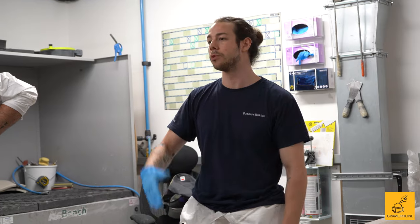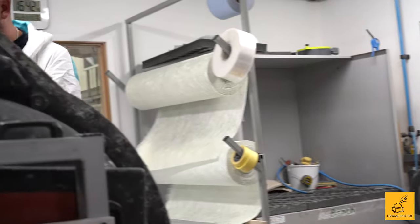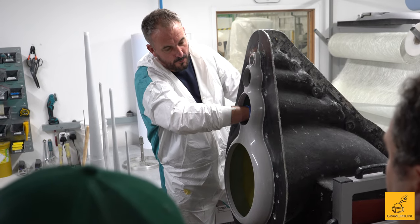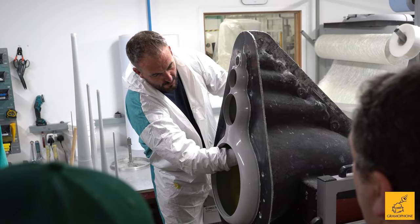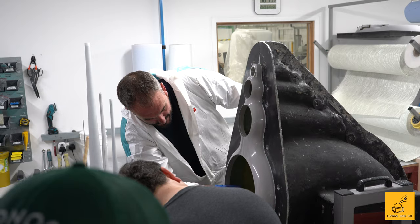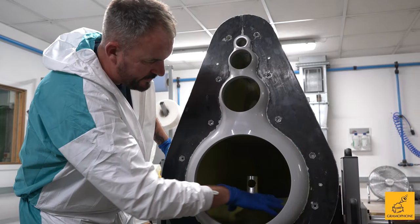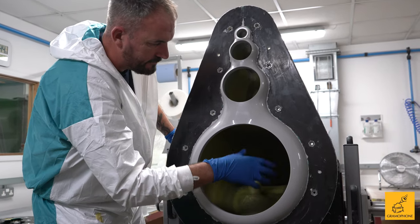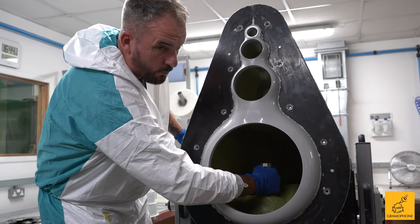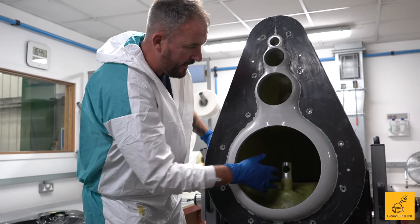The front will go on Wednesday evening. Then Thursday — today — I've been installing a plywood baffle, which is up in there, and then fiberglass all over that to seal it in. Then we've got a tongue piece, shaped like a tongue for obvious reasons, which continues the spirals. That finishes it off and seals it, and then we put sheets of fiberglass on that, soak it with the resin, roll it all out. Then we had the base post — that's still warm because the resin's curing, gone nice and solid. And that's the last bit — put the label in, and that's it.